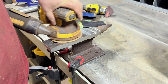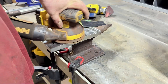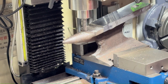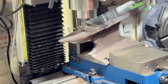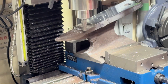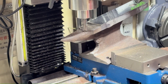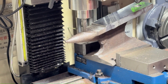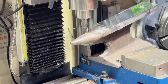With the sanding on the top I decided to try to get some of those gouges out and get it smooth, but unfortunately just misusing that sander was not the trick. On the front, those are tapered in just a little bit on the sides. There's a half-inch carbide bit on there and we're just cleaning up that front for final presentation, tapering it back into the horn on the front — I think it was about a 10 to 12 degree taper.